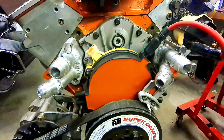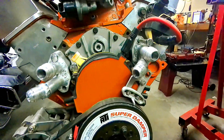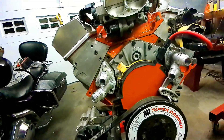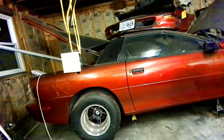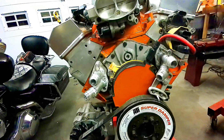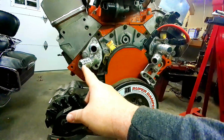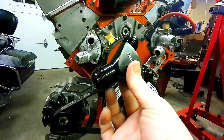We got it all knocked out — both of our water pump block adapters are made and our timing pointer is set down at top dead center, that's in good shape. So the next thing we're going to do for probably the next video is work on that one-inch schedule-40 pipe. We're going to make a hard line to run underneath the car — we'll do two of them and get all that situated so we know where we want to run our AN lines. We've got the dash-12 fittings coming off of our adapters, so these two will tie into this Y and come out as a dash-16 AN on the bottom.